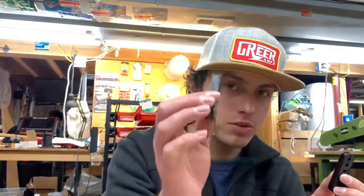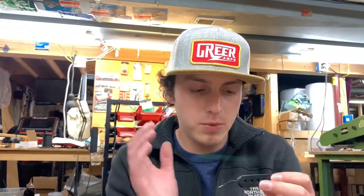All right, guys, we got the slug coil all wound up. I used a different machine for the slug coil than I did for the screw coil, because that's how Gibson did it back in the day — that's how we do our '59 clones, and that's just the way to do it. I wound this one a little hotter, about 5,000 turns, so it probably ended up being 3.7 or 3.8K or something like that. We'll get some tape on this, get it leaded up. One interesting thing I wanted to show you: when I got this bobbin, it was already peeled off — all the wire was off of it.